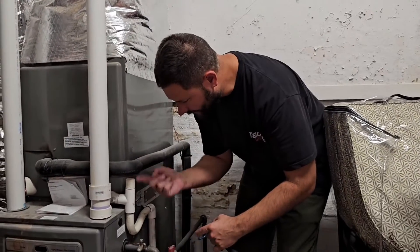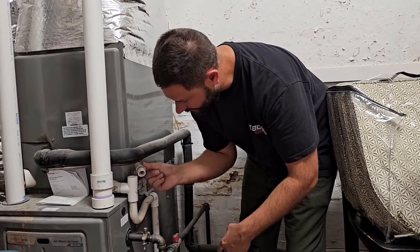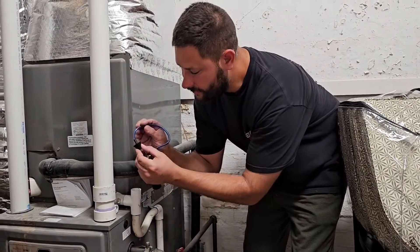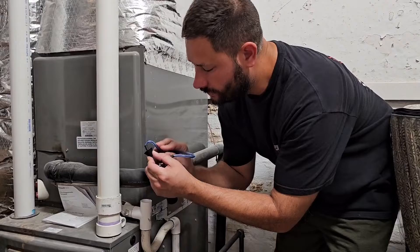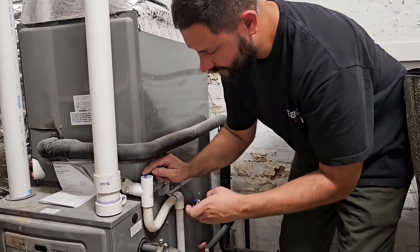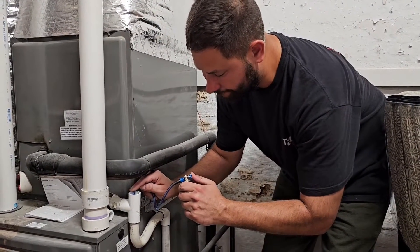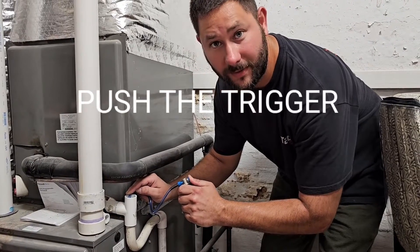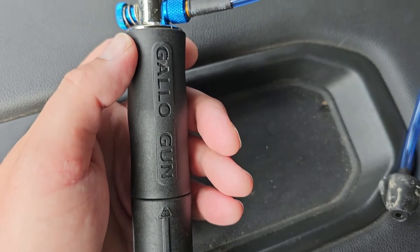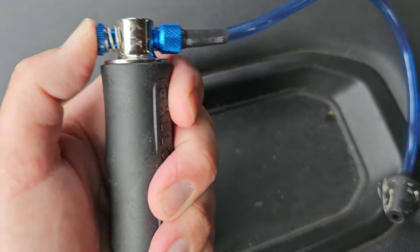You can see I don't have a lot of room here between my line sets and this little cap, so I've got just enough room to take it off. I'm glad that this tube will allow you to bend it. Now I'm just going to shove this down inside — and super simple, all you do is pull the trigger. Hold it for about two seconds. After you load the cartridge into the Gallo Gun, you push the trigger to clear out the drain line.